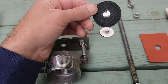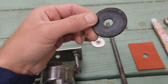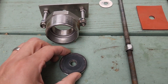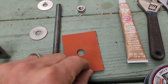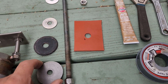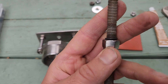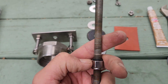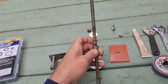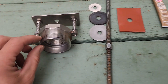I did use a rubber gasket — I made it out of the inside of a tire, so it's a nylon-reinforced rubber, fairly soft. I punched a hole in it; this was the original piece. I also have this silicone rubber that I'm going to use to make a new washer that will go right on top and sandwich it all together onto this shaft. I'll be using an o-ring in between the metal washer and the nuts on this threaded rod, which is about 12 inches long, and Teflon tape to seal the threads.